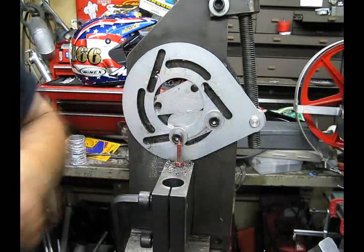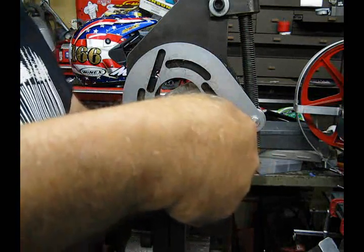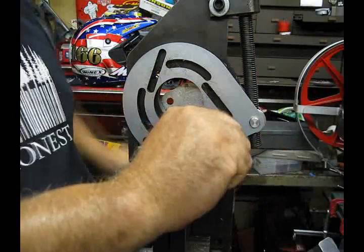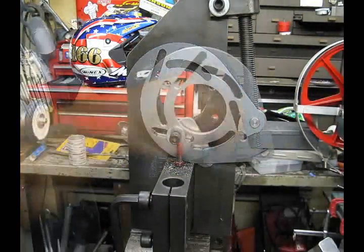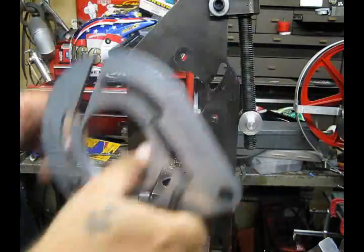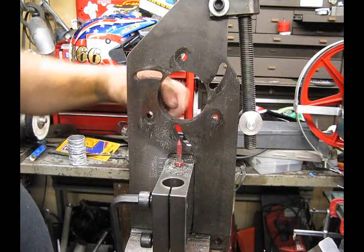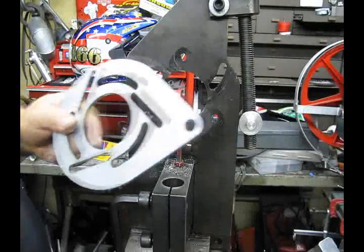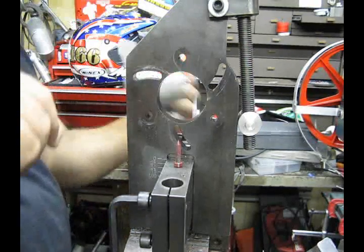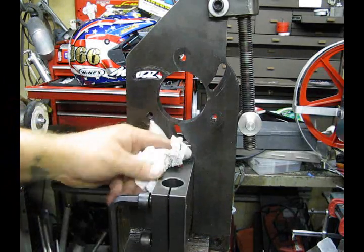Take these off — and there goes another jaw. The jaws will fall out once you remove all the nuts and bolts. We're not too concerned with that because we're going to be replacing them with the Stellar Performance units. This is also a good time to clean your machine. You can see there are a lot of chips and debris that get behind things in the normal course of using this, so give it a brush off while you have everything apart.